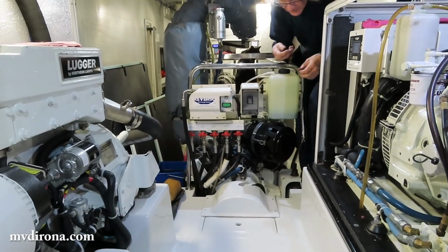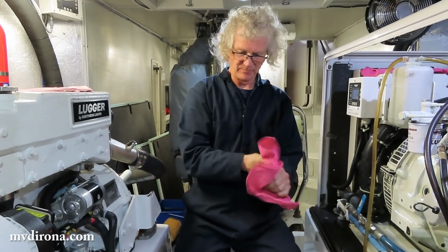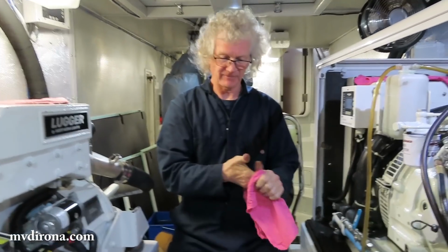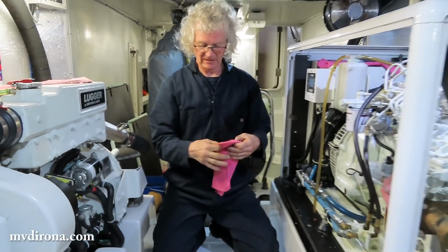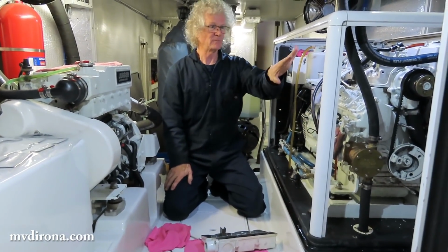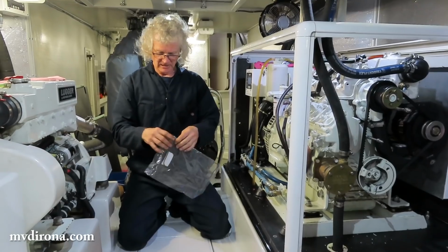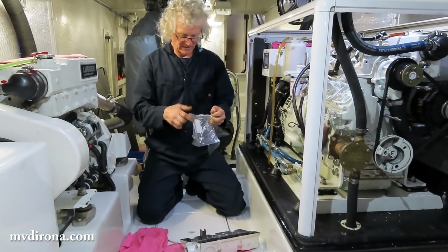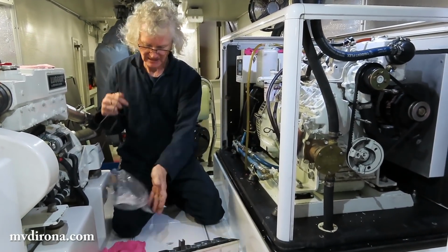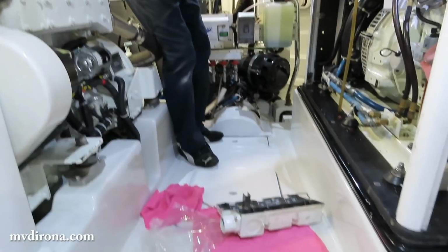So that would eventually start to fail and leak oil? Oh, they last very, very well. The specs on this engine are to adjust the valve lash every 1,000 hours, and at the first 50 hours. So it's been off many more times than 6 or 7 or 8, because we had several quick valve adjustments towards the end. So it's been off almost 10 times, and it probably could do that for quite a bit longer. But on a big job like this, whenever it comes time, I always change the seals, just because it's easy to do and you're getting parts anyway.